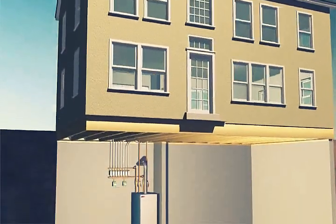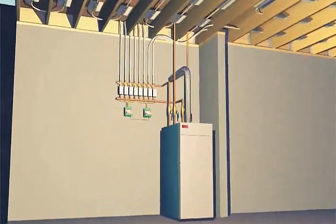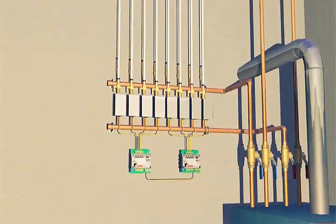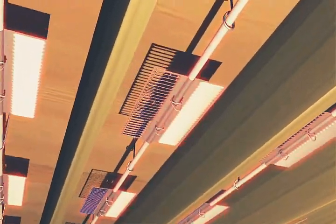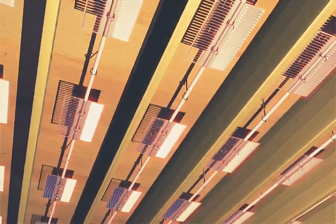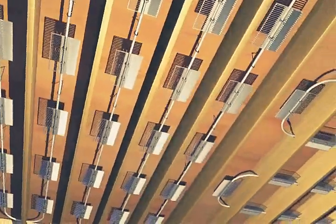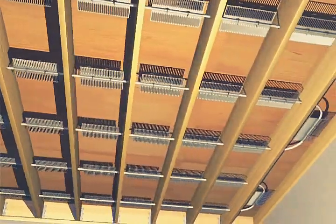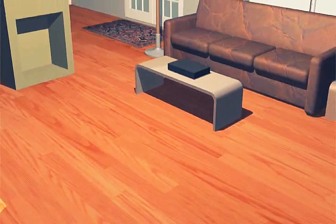UltraFin is designed specifically for wood frame construction. With UltraFin's four-zone valve controllers, water is directed through half-inch pressure tubing suspended just below the floor sheathing in the joist spaces. As hot water moves through the tubing, heat is conducted to lightweight louvered aluminum plates attached to the tubing called UltraFins. The UltraFins radiate heat into the air space between the joists, creating hot air convection. The hot air in turn warms the entire floor, converting it into a giant radiator which transmits comfortable, uniform heat throughout the living space above.